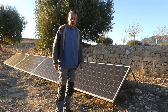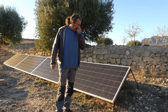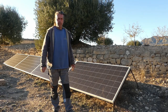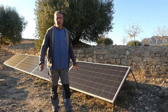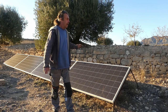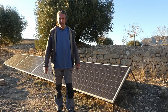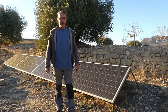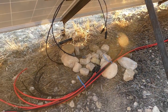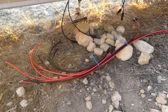All the connections are made and they're ready to go into the junction box and ultimately into the house. We're running out of time to get the junction box in today, but that'll be easy now. The cable should be here tomorrow and the charge controller too. All the wires are ready to go into the junction box, all the connectors are on the panels. I know you can wire them in series to increase voltage, but we haven't got the capacity inside to deal with that.